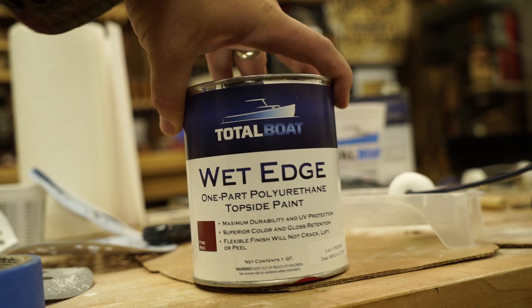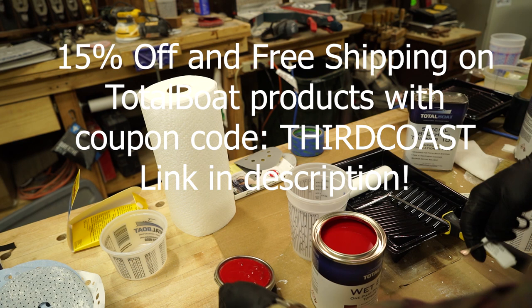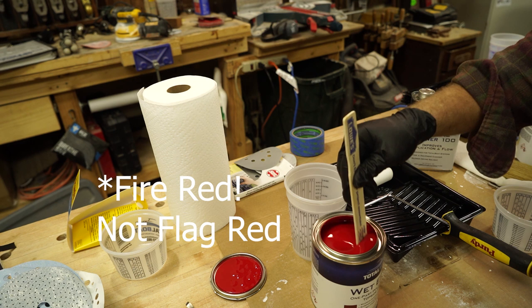I'm using TotalBoat Wet Edge 1-part polyurethane topside paint, and the first color I'm using is Flag Red. I strained a small amount of paint into a mixing pot, and per the instructions, I'm adding a small amount of TotalBoat Special Brushing Thinner to the paint.